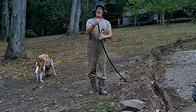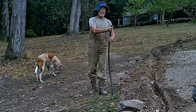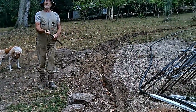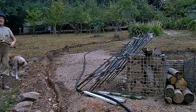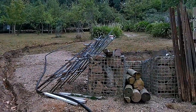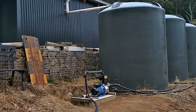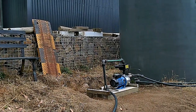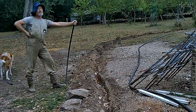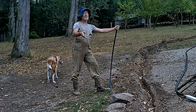In Australia you can buy Rural 1-inch Polypipe — it's got a black and green line and it's strong stuff. We'll put in trenches about a foot deep and run it all the way uphill to the house, using these water tanks as an emergency reserve. The pump sits level with the water tanks — pumps are generally self-priming, meaning they take in water when you switch them on. If the pump sits too far above the height of the tanks, the water will never get into the chamber.